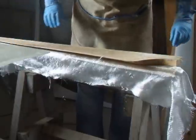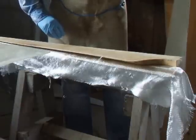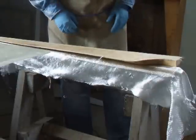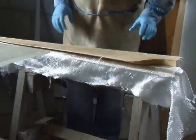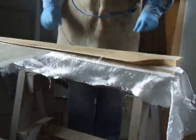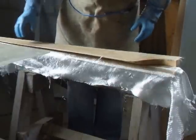So that's the blades — pretty straightforward. And that's what they look like. Just use a normal gel coat — I'm just using a white gel coat finish. And again, you can smooth that down. You can put more layers on until you get to a perfect finish. It's also a good way of using the gel coat to balance out your blades. So you can weigh each blade, and if there's a slight difference in weight, you can just put a little bit more gel coat on, rather than messing around with weights after your blades are finished.